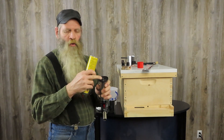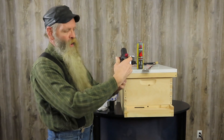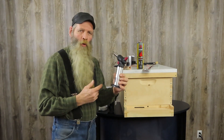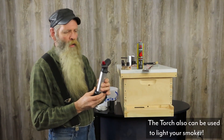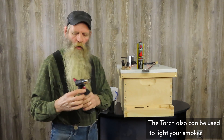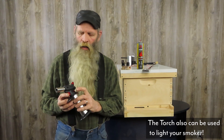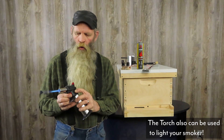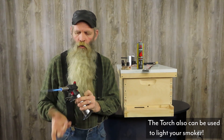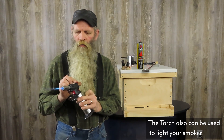When it fills, it'll start spewing out a little bit. On the torch there's an indicator to let you know when you are full on butane. First off you have your flame regulator knob which is on the top. You have a trigger for the igniter and this is a lock — you have to push the lock before you can get it to light. If you let off the lock then you can let off the button and now you'll be able to adjust your flame.